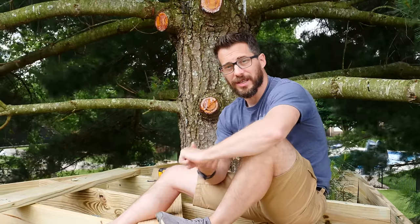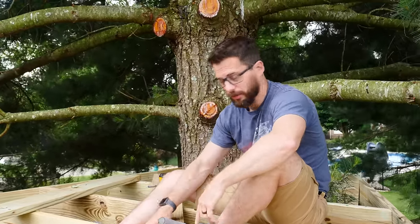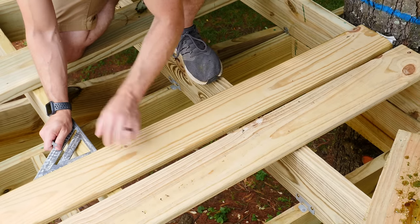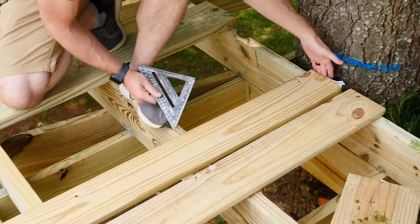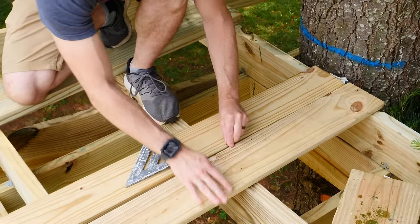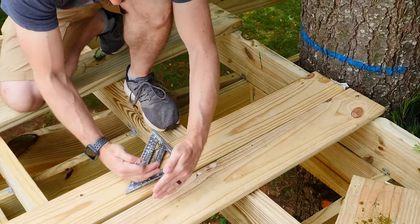We had to buy a whole bunch of decking and this whole thing is sponsored by Lowe's. If you don't have a way to get a bunch of decking to your house, you can actually buy all this lumber online on lowes.com and they'll deliver it — pretty cool. To lay down these boards, I'm just going to make sure they are perpendicular to the joist using a speed square laid right here to line up the outside edge. I'll use nails as spacers between boards to give a little bit of room for expansion and contraction between the pieces.